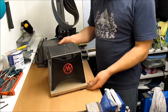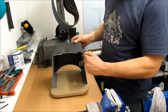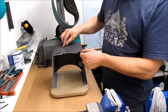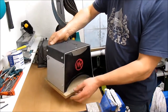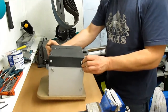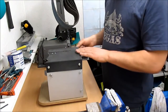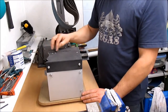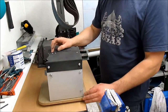This is the first one that I made. Just basically steel bent into sort of a box. It's shaped for the saw, so you get the saw nice far at the front. I did quite a small base to start with. Obviously, me being right-handed, it's handy to shape with stuff over this side, which is why I did most of my sawing. Just basically bolted through using the standard foot, just with some longer bolts, 3mm longer bolts.